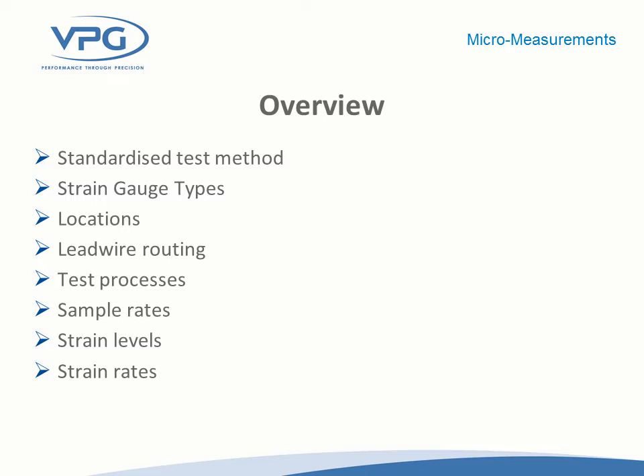The gauge types basically drove the beginning of the C2A series of strain gauges. They have small enameled wire between the gauge transitioning to a 26-gauge piece of wire. We have an option that allows us to add 20 inches of that enameled wire so that routing it off the circuit board and through the fixturing is a little bit easier. That's a standard option we offer with the C2A series — the SP20 option.